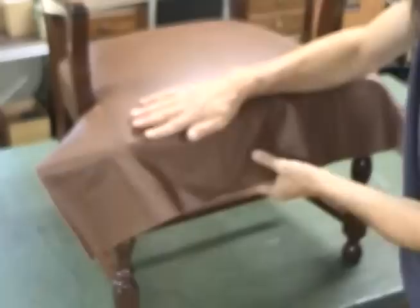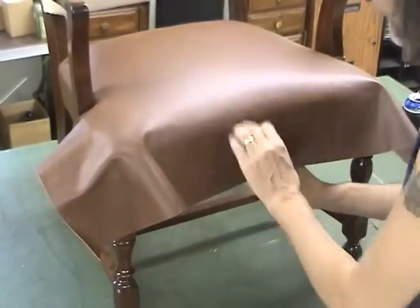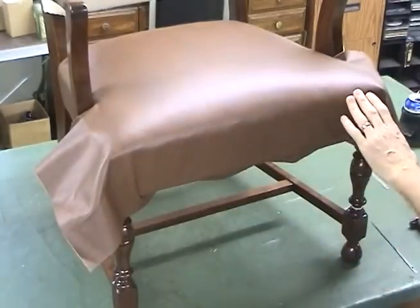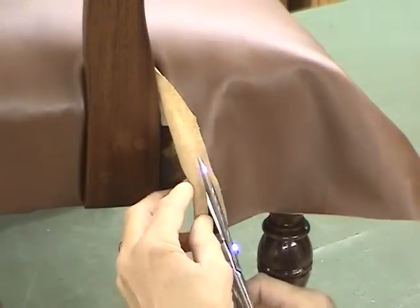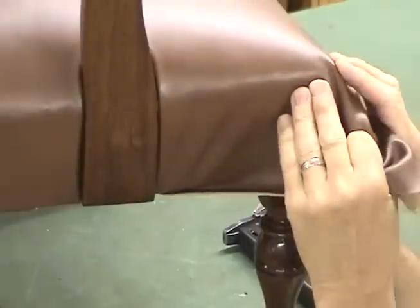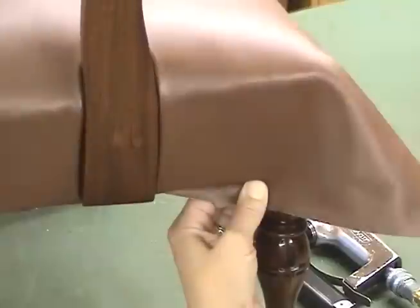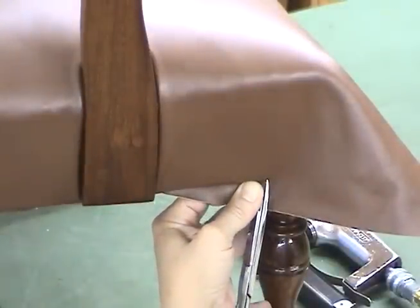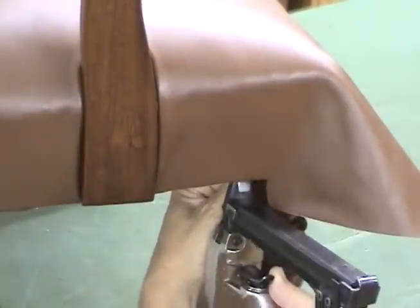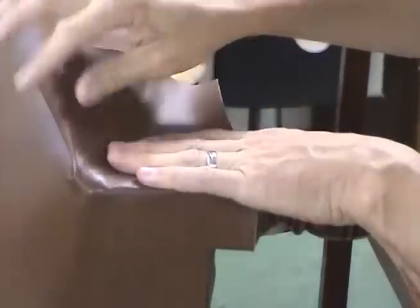I'll give this leather a brisk rubbing towards the front and work it towards the outer corners. I'm going to shoot a few temporary shots in here just to keep it snugged up. I need to work this out over the corner and get a pinch right down here in the corner where this rail needs to lay. Snip up close to that.